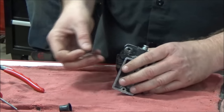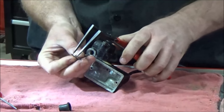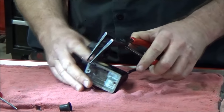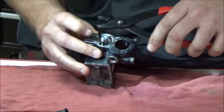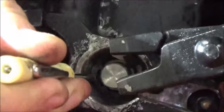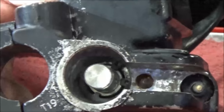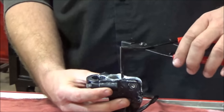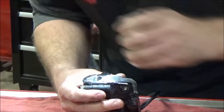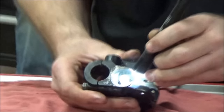I'm going to preload my snap ring in the direction I want - flat side out - and take my specialty pliers. I told you it's going to be much easier this time. I'm going to put a little pressure here. We know the trick of snap rings - I want to put a little pressure and rotate it around to really verify that I'm in my groove.